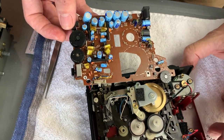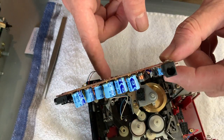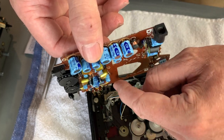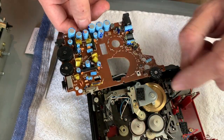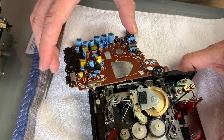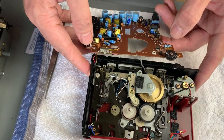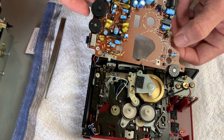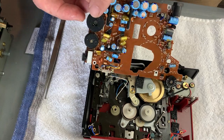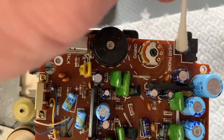There we go. And you may have seen, as I did, that the blue and white ones from the leaf contact that we just desoldered sort of slide out through the little square hole. And that basically just allows you to open it a bit like a book. So there we go. We can see the electronics in there. We can get to the potentiometers to clean them if we so required. Yeah, all good stuff.